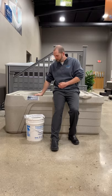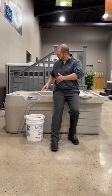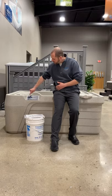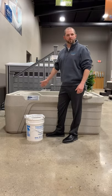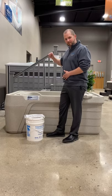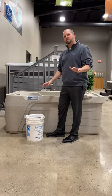I just plugged in our little mini here, so it starts up. We left the filter out as we filled in order to prevent any air bubbles in the system. When it starts up, it is possible that there could be an air bubble remaining. I always like to start the unit up and let it run for a few moments. It goes through its startup modes — some people call it a tranquil cycle — and it'll give us a reading. If you're not getting any water movement, hit your jet button to try to cycle it a bit more. If you continuously have problems, you may have to get the hose back out, stick it down in the filter, and run some water through those plumbing lines to get that air bubble out.